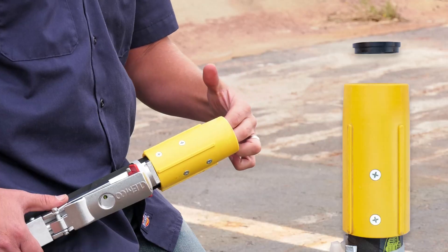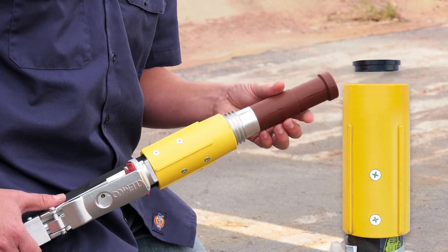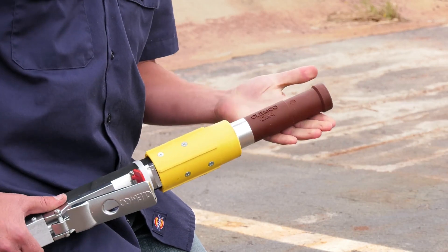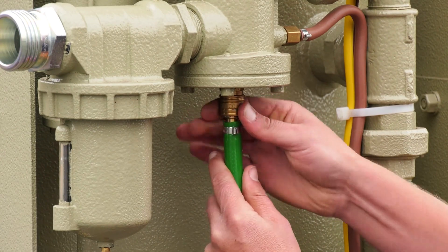Choose an appropriate nozzle and attach it to the nozzle holder with a gasket. Place a nozzle washer in the nozzle holder. The nozzle must seat tightly against the nozzle washer. Connect the CPF air filter to the RMS 2000 remote control.